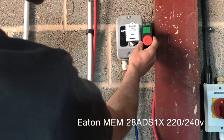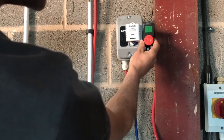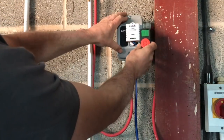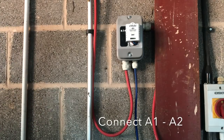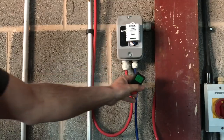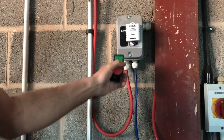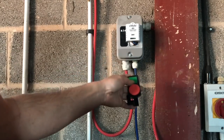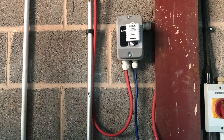When you first buy this unit, it's going to have, in this position here where I've got the remote receiver, a start and stop button — which is how it functions when you first buy it. There are two wires inside which you can move, like jumpers. This button, being the on-off, then allows a voltage to switch the unit on and off. So it's basically the remote that is switching the unit on and off, rather than these buttons. And it took me about five minutes to do that.